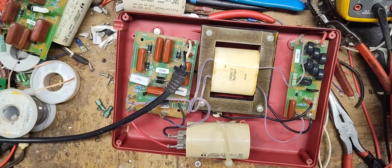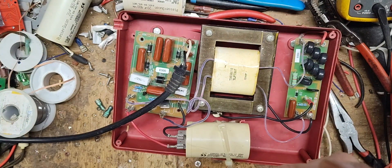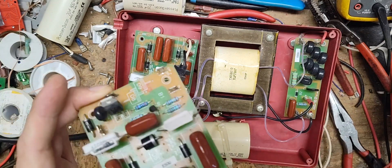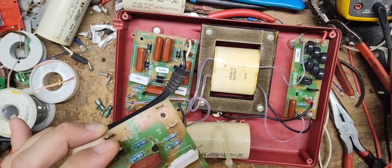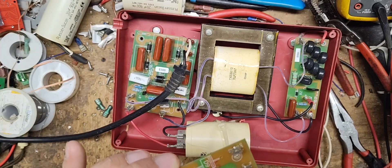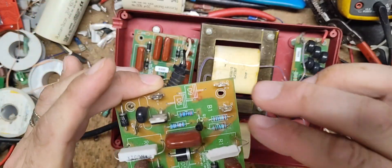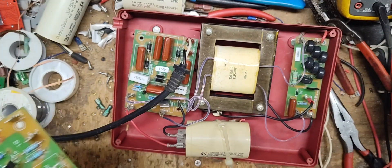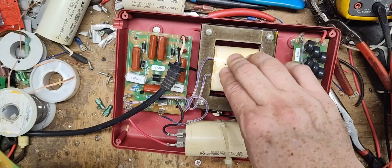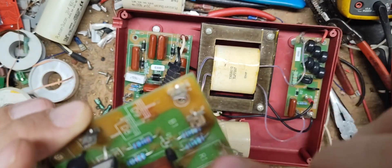The only thing we need to do next is get the parts. We don't have them here, so we'll go online to somewhere like Mouser or Newark - a reputable online electronics store. We'll order some other stuff to keep the overall shipping down, then try to fix this original board and check out all the diodes as well. It's a pretty basic setup: AC input coming in here, your main SCR triggers and fires, discharging all the energy out of the capacitor and dumping that into the transformer. There's a small transistor or MOSFET tied in with the timing.